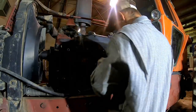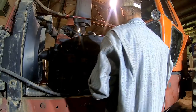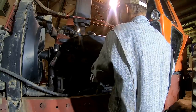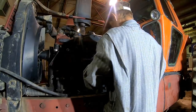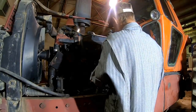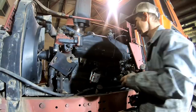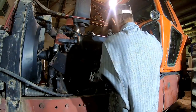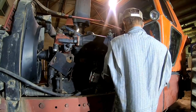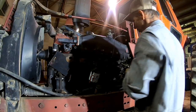Then the old Marmon dump truck showed up out there. I don't know if he's got a brake cam over. He's got a wheel seal out on the right rear drive axle, but I mean, you release the brakes and boy, if something drags, the clutch needs to be adjusted bad on it, but you get going with it and you can push in on the clutch and it stops itself, so there's something dragging pretty bad. Them old Marmons, man, they were hellacious log trucks, really tough trucks.